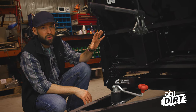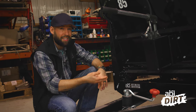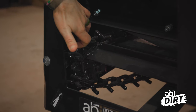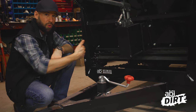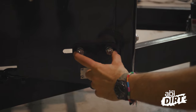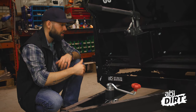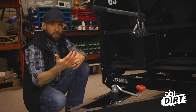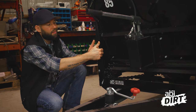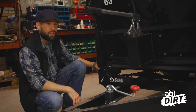Here on the front of the unit — the 85 ground drive — here's how to adjust that tension. If you've lifted up that chain and you see four or five inches and want to bring that tension back down so you don't get any big rocks stuck underneath there, this is where you do it. These sprockets up here are mounted to a plate that slides back and forth so you can increase or decrease the tension on the apron chain. You've got two bolts on the side of the unit — both of those need to be loosened up to free the plate so it can slide where you want it to go. Then this bolt head here is what you turn and adjust to move that sprocket: closer to the body if you've got too much tension and need more slack, or forward if you've got too much slack and need more tension. Once you've got it where you want it, tighten those two bolts right back down to lock in your tension.